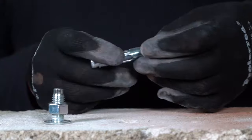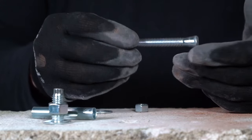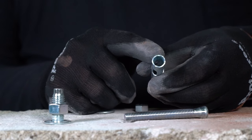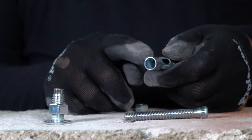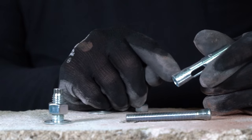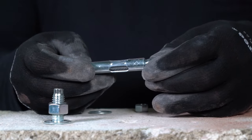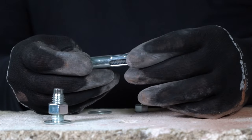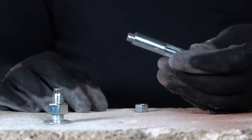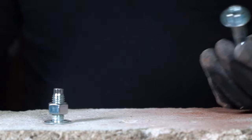I'm going to show you how to install this sleeve anchor, but just to show you a sleeve anchor — basically it's a wedge anchor at the bottom here. You can see the wedge and it has a sleeve on it, which has slits in it and also cross cuts in the bottom. These cross cuts are what grips the concrete when you install it. This wedge down below, once it's in place, pulls up into this area — you can see the slit and the steel that will allow it to expand. That's basically how a sleeve anchor operates. It's a pretty simple methodology.